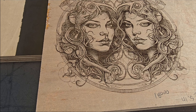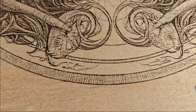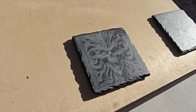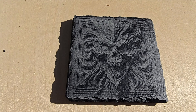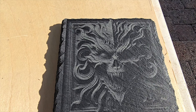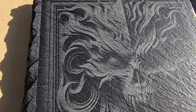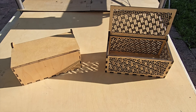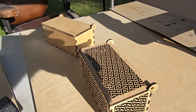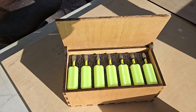I tried running the same image on grayscale and it came out very smooth. So I got some slate out to try 3D images like you see on high-end machines. The first coaster I ran at 15% power maximum, 7% minimum, then dropped to 12% power with 4% minimum — and it is just incredible, like the image is coming off the table. You're almost scared to put your finger near it thinking it'll bite you. I was able to cut a box in less than 10 minutes, and a more detailed one took a little longer but it's perfect. Right out of the box this machine has cut and engraved absolutely amazingly.